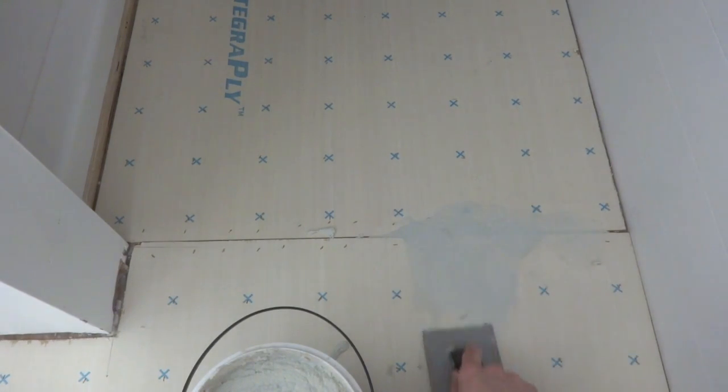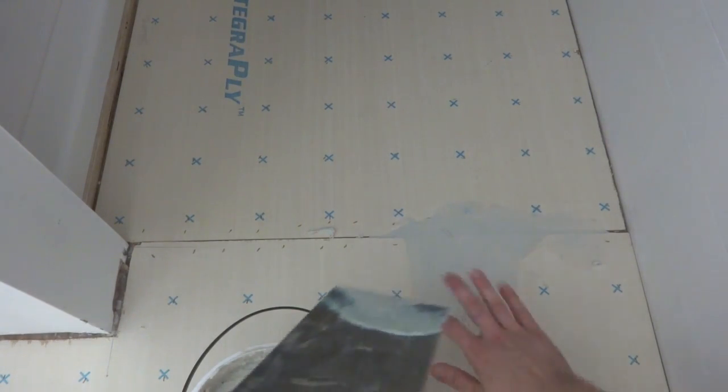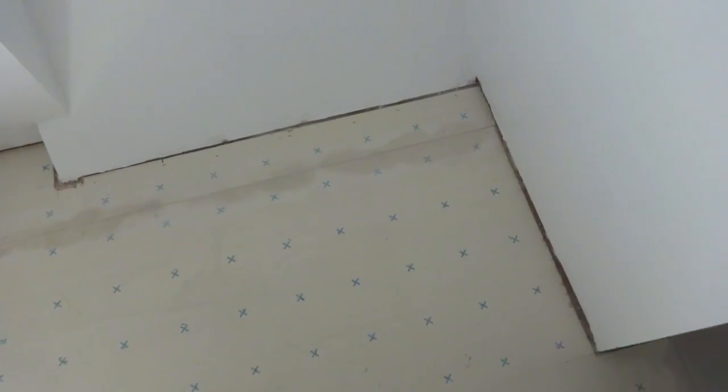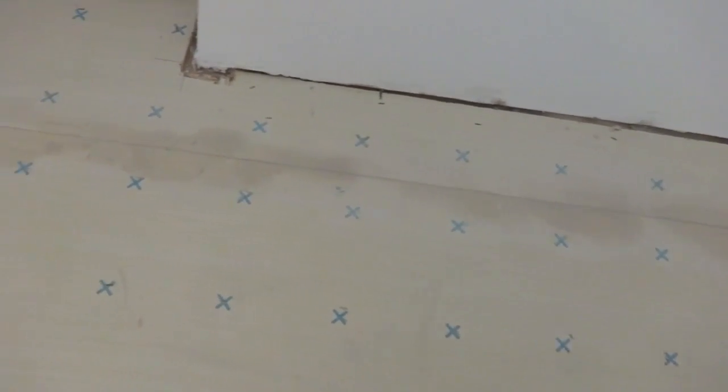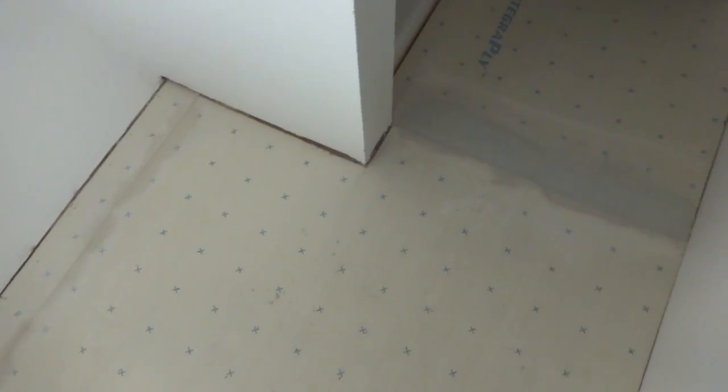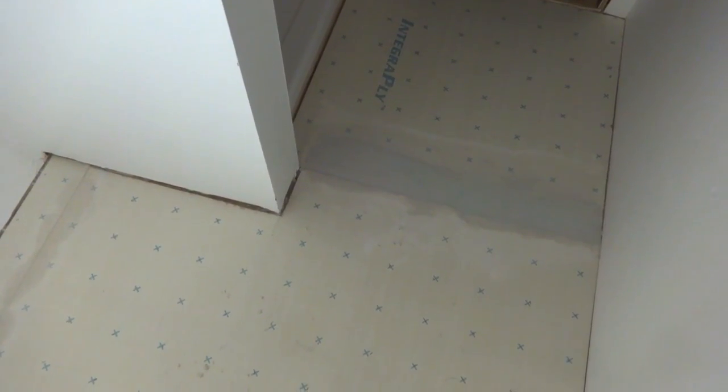The container says you have to let this dry for three to sixteen hours, so doing floor tiles tonight isn't going to happen. I'll put it on tonight, let it dry, sweep up the sandy residue tomorrow, and then finally put down the VCT vinyl tiles. Doing both seams only took about 20 to 25 minutes - not too bad. That's pretty much how you install the underlayment.